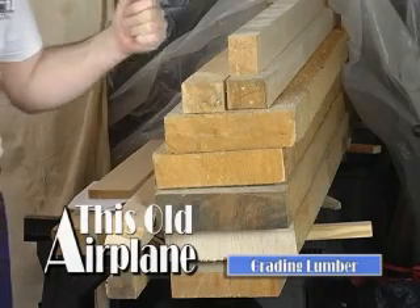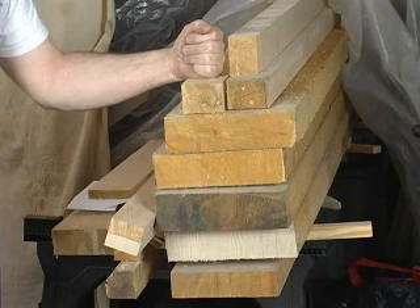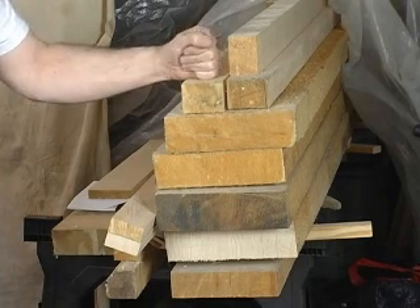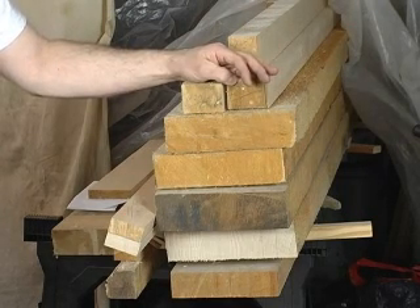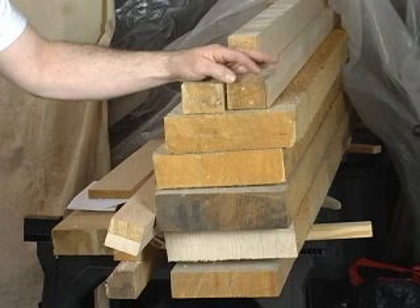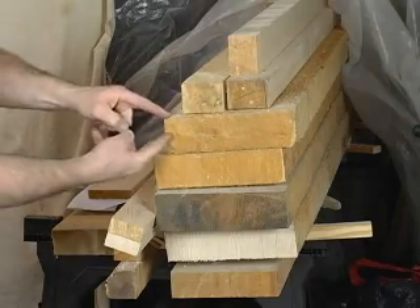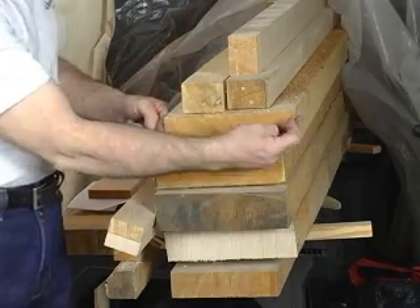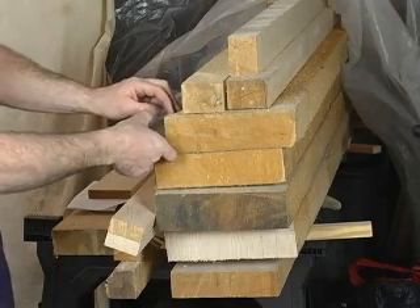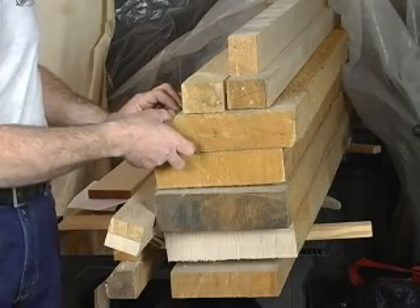When building an airplane, you need to consider the grade of the wood. You can't just go to your local lumber yard if the aircraft is going to be licensed experimental. We buy our wood from select lumber mills that sell wholesale only, requiring large quantity orders in the neighborhood of six to eight hundred board feet. A board foot is one inch deep by 12 inches by 12 inches. One inch thickness is called four quarters, so two inches is called eight quarters.